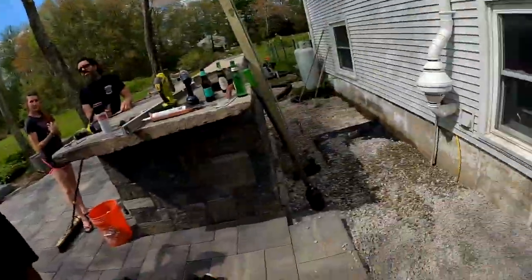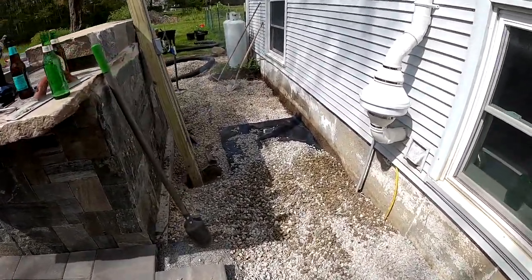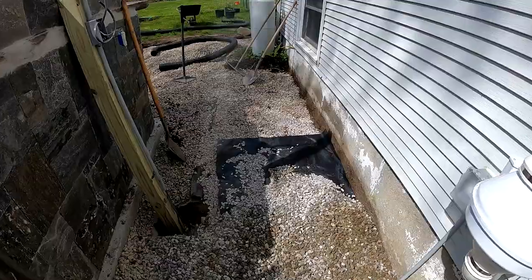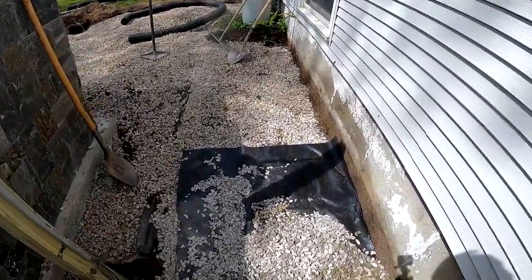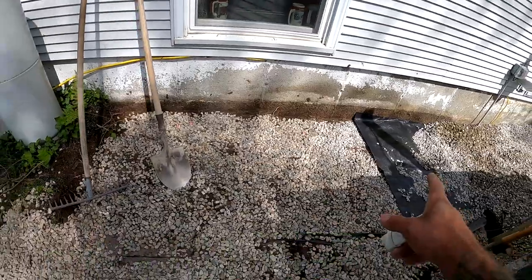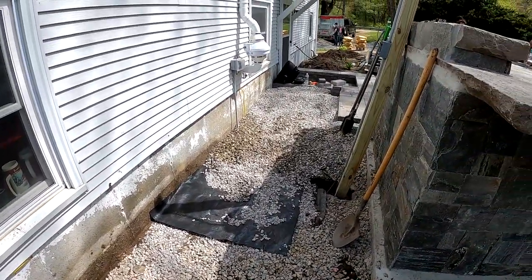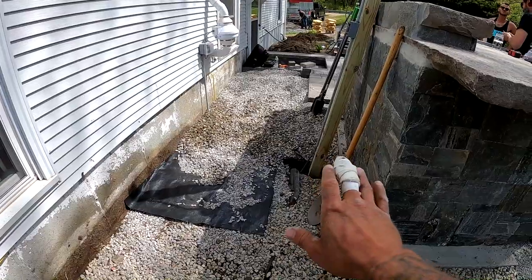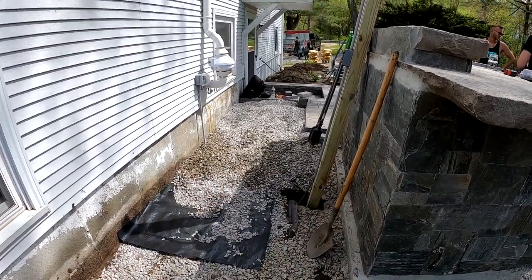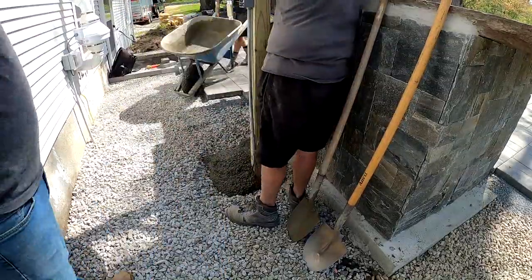We're killing it. So, all the back up against the house excavated, compacted, got some fabric down. One more piece of fabric to go here, but we're good. We get ourselves to grade and we're gonna extend the patio right to the house. We got the pavers, so we're gonna do it. Stay tuned, guys. All right, we're on to setting this light post here with some concrete.